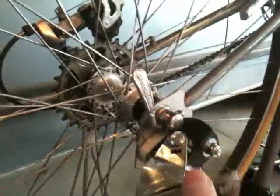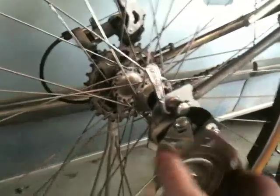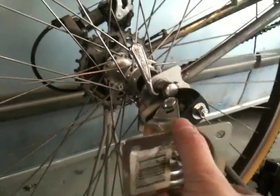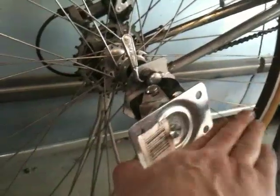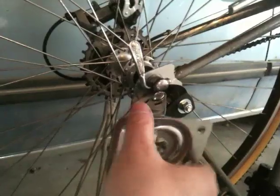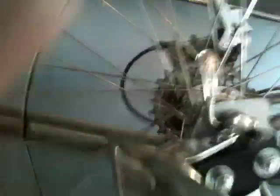The caster wheel has two axes of rotation: yaw and pitch. The third axis of rotation needed is roll. We get that by fitting a piece of PVC pipe to the caster wheel mounting plate via two U-bolts. The trailer arm will rotate freely inside the PVC pipe, giving the side-to-side roll movement needed for traveling over sloping terrain.